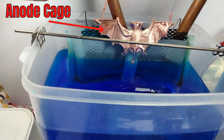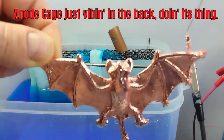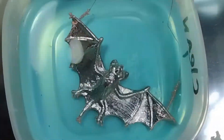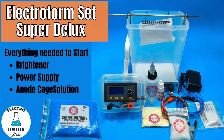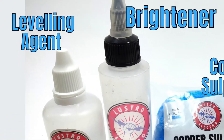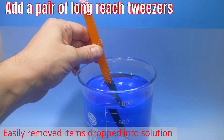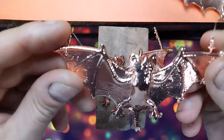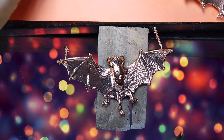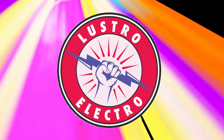It's been about 15 hours, and since it's going to be a pendant and the bat itself is very durable, the plating does not have to be super thick, so I'm done plating. It looks really good, nice and bright. Let's give it a rinse and take it to my bench. All my electroform projects are done using my electroform sets and Lustro Electro Super Bright Electroform Brightener, available on my website and Etsy shop — all items ship anywhere in the world, links in the description below. These bats are right out of the bath; all I did was rinse them off. The texture on the hang wires was from me dialing up the current a little too fast from the beginning, but otherwise they are super bright thanks to Lustro Electro Super Bright Electroform Brightener.